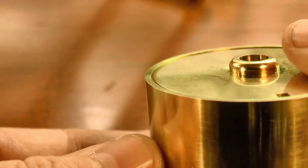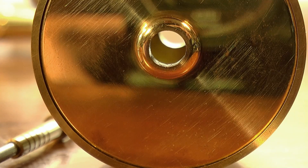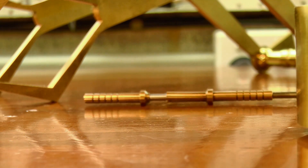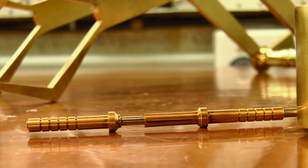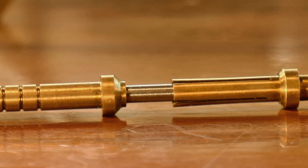There's a similar issue regarding the dimension of the inside of the barrel. The cap has to be in place to give the true dimension, but then how can the inside be measured? The American clockmaker Bill Smith came up with a beautiful solution many years ago — this barrel transfer gauge, which I'll use later in the video.